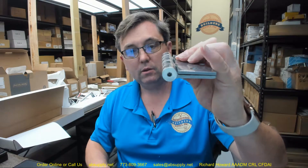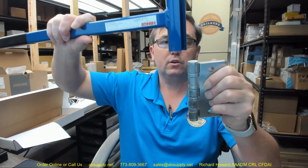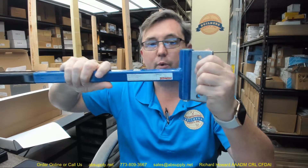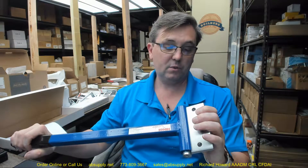What does the hinge look like in it? I happen to have a heavyweight hinge here. This is a 4.5x4.5, so it's 180 thousandths thick. You can tell it's heavyweight because it has four bearing packets. You're going to slide the tool over that barrel. Now you're ready to make hay — there's no doubt about it. With the amount of leverage that you can put onto this hinge, you're going to be able to affect a change in the swag of the hinge.